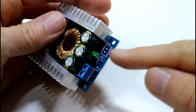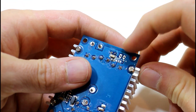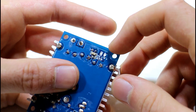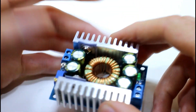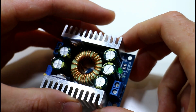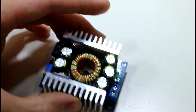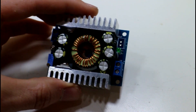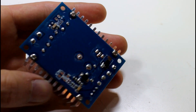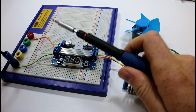If you're going to be doing 8 amps, I'd imagine you need the fan operating. From what I can see, the fan appears to be powered from the differential voltage between V-in and V-out. So if you're trying to go from 36 volts down to 1.2 volts, there'd be a huge potential difference and your fan would be going fairly flat out — and since you're also trying to drop a huge amount of voltage, maybe that's how the heat is generated.